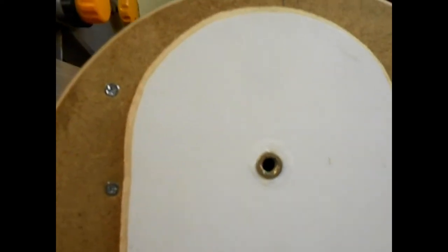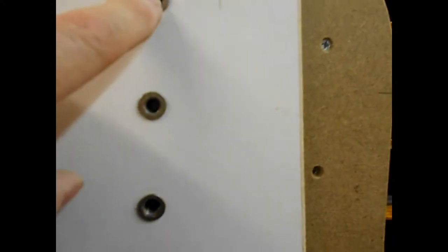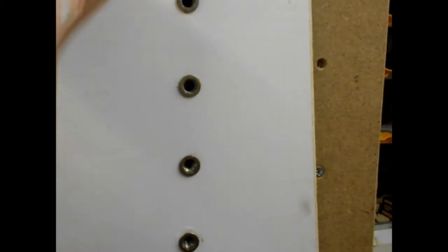However, I don't expect I'll be cutting many 7.5s anyway. I mean, a lot of this modification has been so that I can, but it's not that commonplace a radius. I think it's the old Fenders that use it. I'm more likely to use the 9.5, the 12, 14 and 16. The Winfield guitar that I'm working on at the moment, I don't know whether I said this already, actually has a radius that's greater than 20. It's almost flat, really. It has a slight radius, but not much.